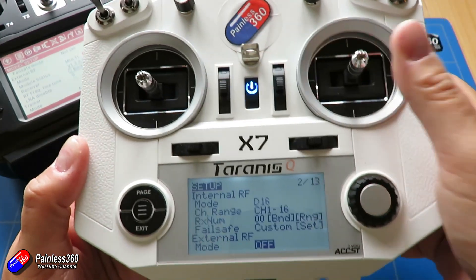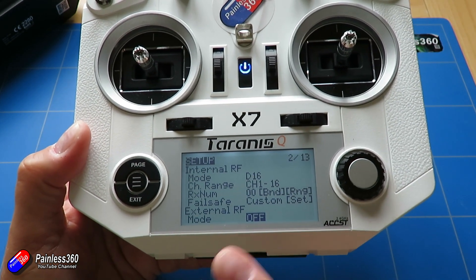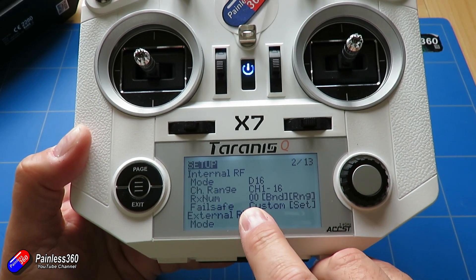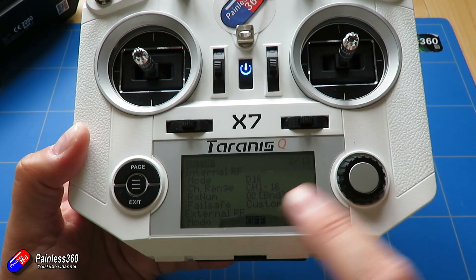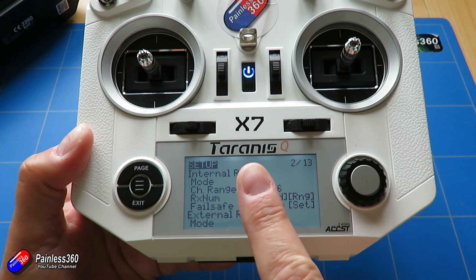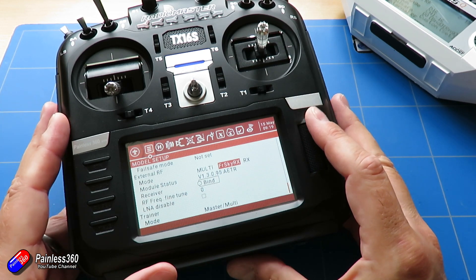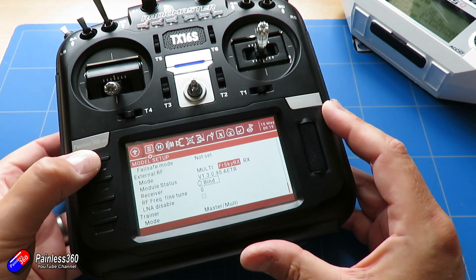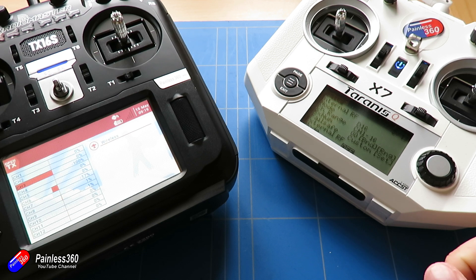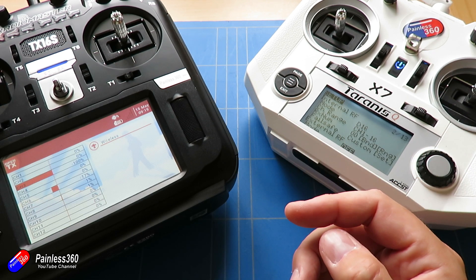So let me show you what that looks like on the other side — with our friend the QX7. Let me move them slightly further apart. You will see here that this radio is bound to the 4-in-1 module at the back and thinks it's a receiver. So I'm using D16 here, and the big important thing here is the RXNUM — the receiver number — is 00. I found that if it isn't 00 in this current version it won't bind. However, if you're using the later version, then you just make sure that the receiver number — whatever is in here — is also the same inside this part of the menu at the bottom of the second screen, for your model setup where you have all the basic settings. Then you can give your older radio or something that runs D16 to your mate, and they could either control the gimbal, the camera, or whatever on whatever quad you're running.